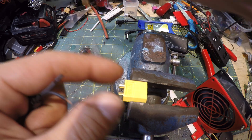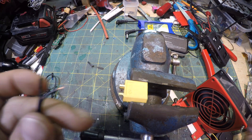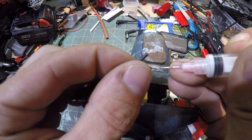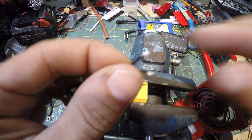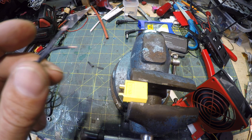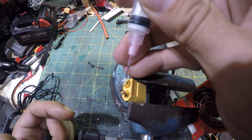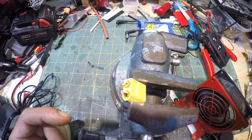Here's how you do it. I like to put my stuff in a vise, so I got mine in a vise. You could use helping hands or whatever. Then you get a little flux. Flux is one of the most important things in soldering. People think that flux is inside the solder - yeah, it is, but it's nothing really that usable. You're going to need some flux. Get some flux on your connector, whatever connector you're using.